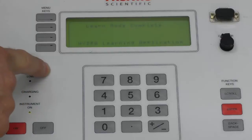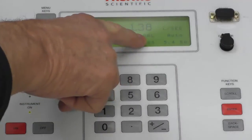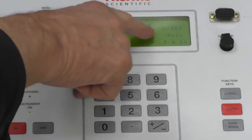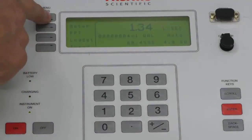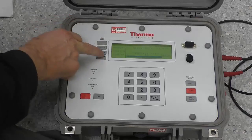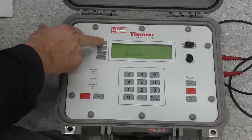Learn mode is now complete. There's our flow. You might notice that the accumulated flow is in gallons here, but there's our flow in liters per second — it's 1.36. We can change the accumulated flow units under the Setup menu, so I just need to go to Setup and then Config.